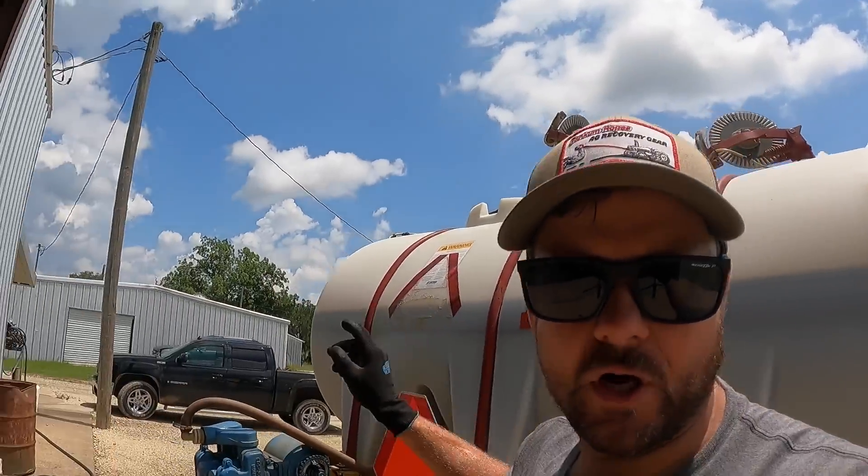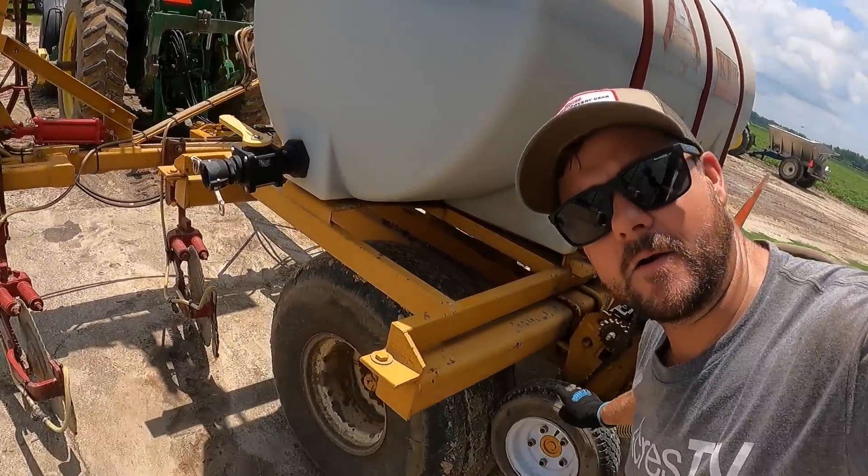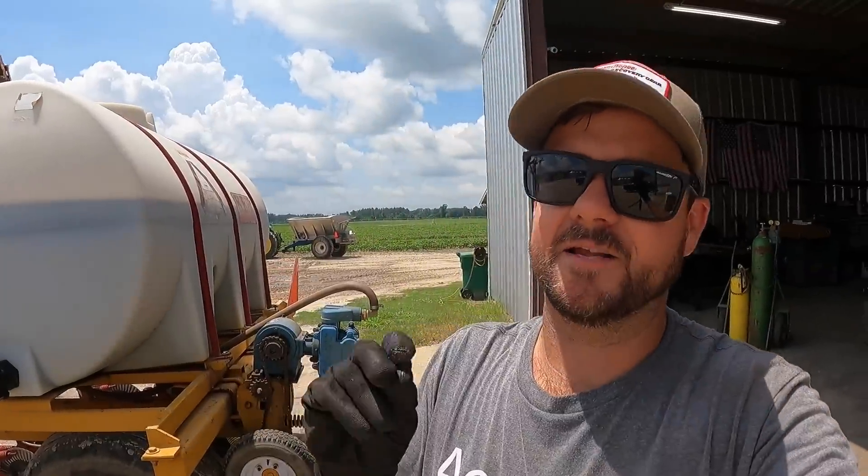Fingers crossed, we've got it. It's 70% better — nowhere near perfect. We really need a whole other threaded rod to put through there, but we're going to put it back and hopefully that's where we need to be. This is your John Blue pump — it's what turns everything. This little tire touches the big tire; the little tire didn't have enough pressure against the big tire to turn it. This turnbuckle rod is the only way to adjust it.